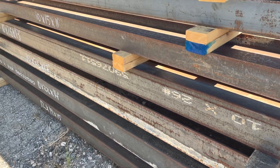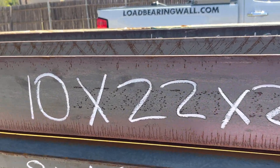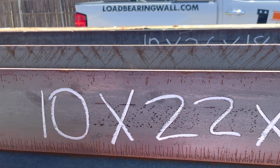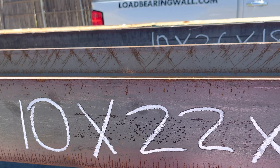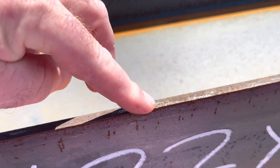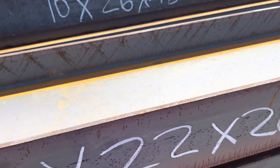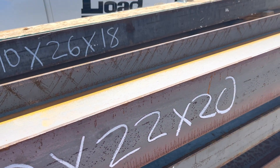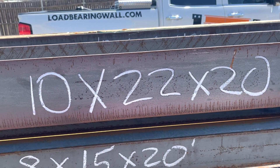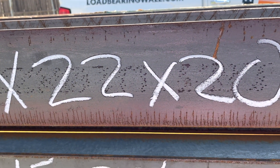This is the pile of beams going out for this week's work. The way steel beams are named — the naming convention — this is a W10. The first number, 10, refers to the depth of the beam, so from this flange to this flange. This beam is in the 10-inch family. They're not all exactly 10 inches; there's some variation as the beams get heavier and sometimes a little deeper, but they're within a quarter inch of 10 inches thereabouts.